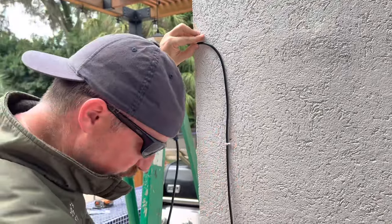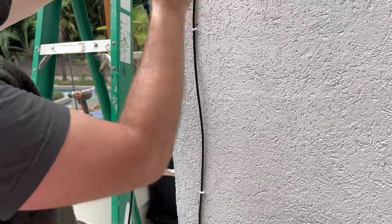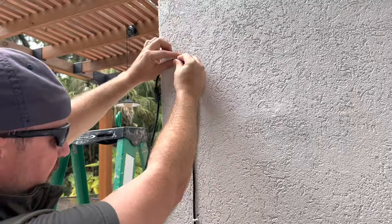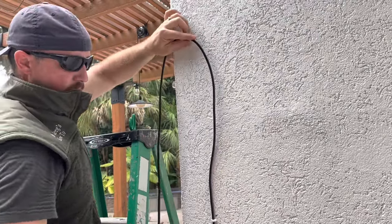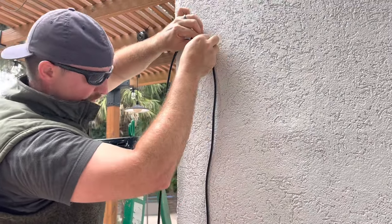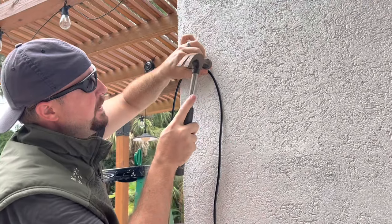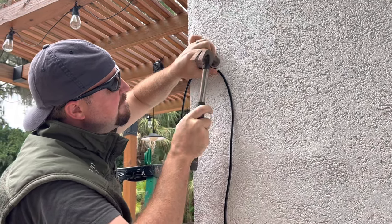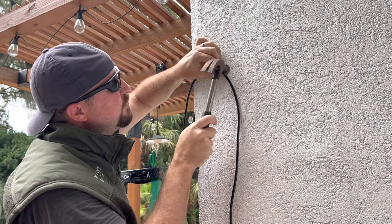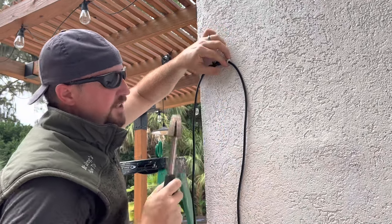You don't want these to be too tight — just loop your wire line through here pretty loosely, and about every foot and a half you're going to install one of these little clips. This clamp has a nail on it and it'll work in stucco, wood siding, or whatever else. You want to see what's going to look like a good length. We're going up about a foot and a half, trying to keep them in some sort of a line. If you want to paint this white or something, you could, to make it blend a little more — we may do that later. You just want to nail it straight in.